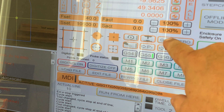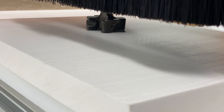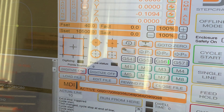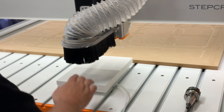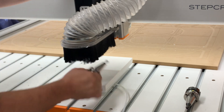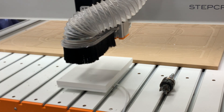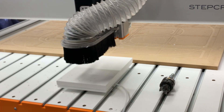If I hit go to zero, you can see the end mill is right flush on the surface of the material. The next thing I want to do is hit G56. I'm going to raise my spindle, push the button to eject my surfacing bit, and install my quarter inch end mill. Now I'm going to do the same thing as far as touching this off, but now that I'm in G56, I'm going to touch it off for that particular work offset.